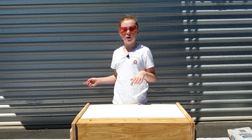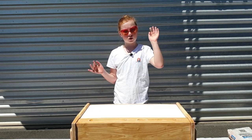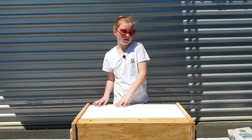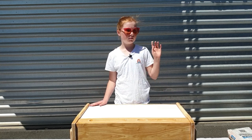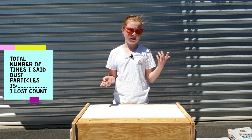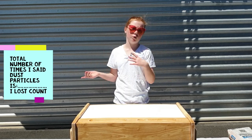Now I've finished wiping it down and sanding, but it's actually getting really hot. Instead of painting now, we're going to wait until later in the day when it's cooler, because the chalk paint is designed to dry super fast and in the hot sun it will dry even quicker. We feel we've prepared really well, so we'll wait to mask it up and paint it — we may not even have time for the adhesive today.